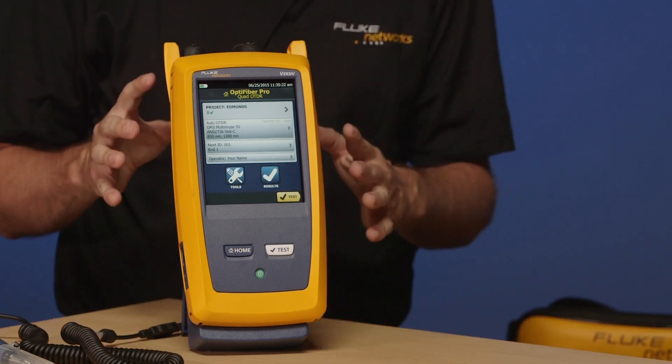You may be worried about the amount of memory on the instrument, but this is a modern instrument and it has plenty of memory — you can store over 5,000 OTDR test results, including graphs in both directions. In a further video, we're going to show you how to extract those results. One final point: don't forget the first time you get this, plug the power in and charge the instrument up. We're only allowed to ship it at around 30 to 35%, so make sure you do charge it up. That's the basics of the OptiFiber Pro — let's go to the next video and show you how to set it up for a successful OTDR test.